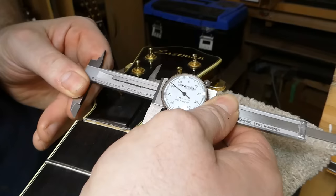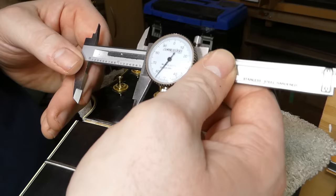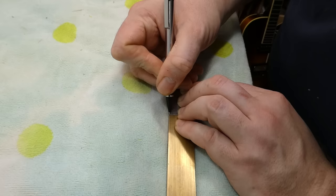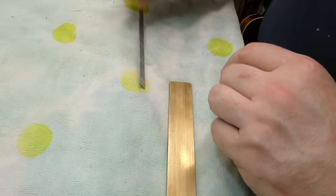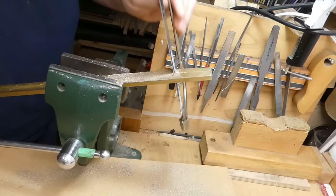I've purchased quarter-inch material, so we should have some room to play — and we don't. The billet measures 238 thousandths, so very little room to spare. Oh well, we'll make it work. The nut width is 1 and 3/4 inches — a suspiciously American-sounding increment — which would be about 44.5 millimeters. I don't have a Bridgeport mill in my hundred square foot workspace, so I'm going to be doing this all with hand tools, just like they did in the copper age.